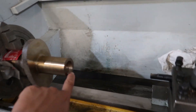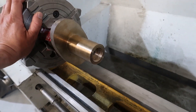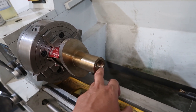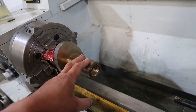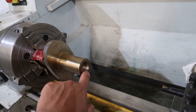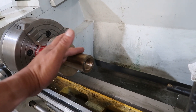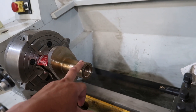What I'm going to do now is take this out, just double check this thread here for the measurements to match the shaft. Then I'm going to realign this, bore that out to the proper minor dimension - I've just got to check the minor dimension for that size thread. And then we'll redo the threading if possible.